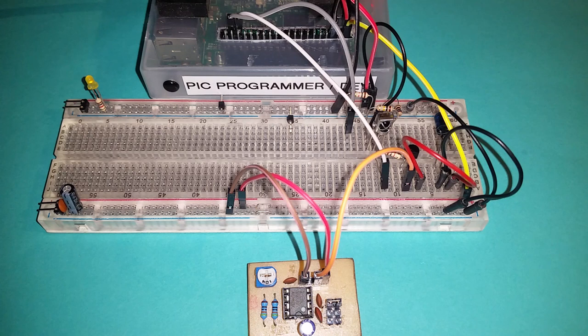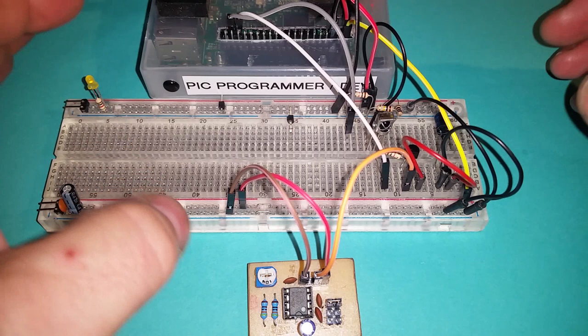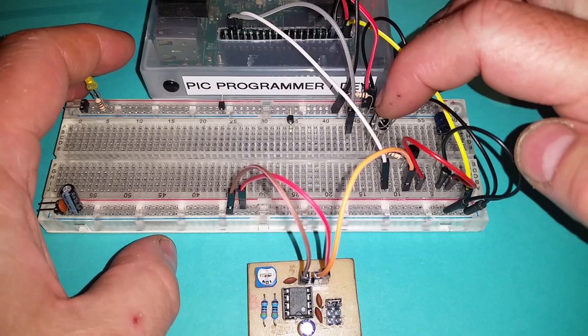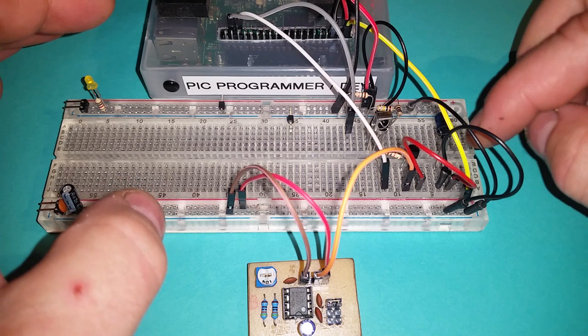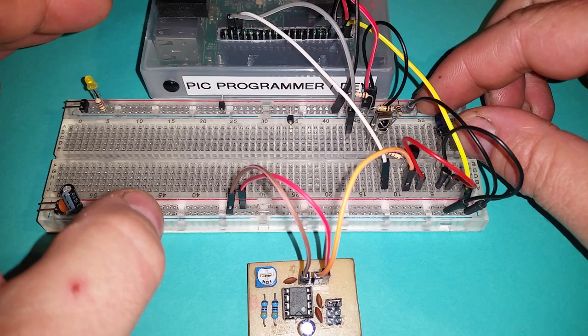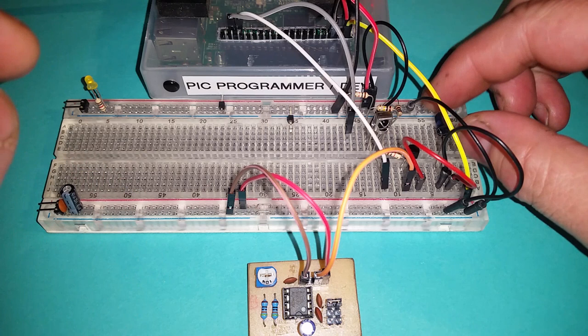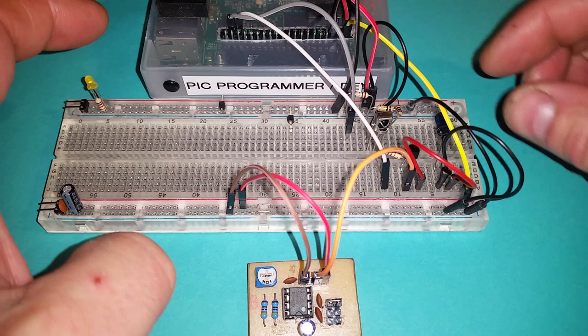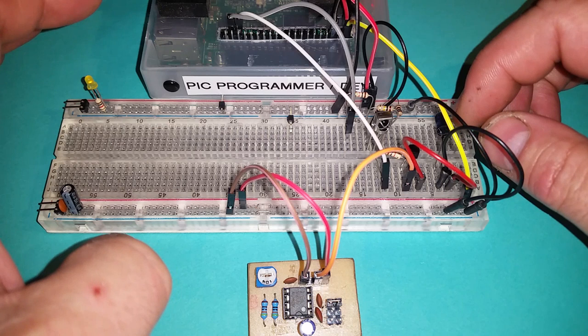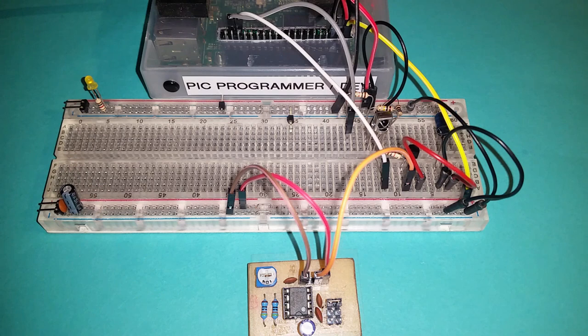In my previous video I set up two Raspberry Pis and sent data between them over an infrared link. This is the same circuit but with only one Raspberry Pi this time, with an infrared receiver and an infrared LED to transmit. I've removed a resistor from in front of the infrared diode to get a longer range. These infrared diodes vary quite radically in specification, so it's best to experiment and tune for the best range for whichever diode you've got.